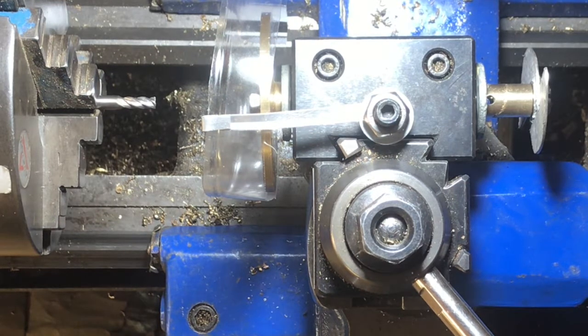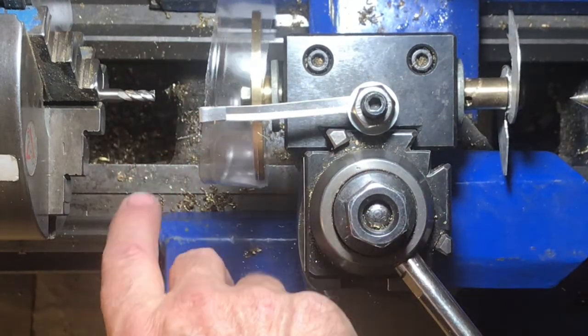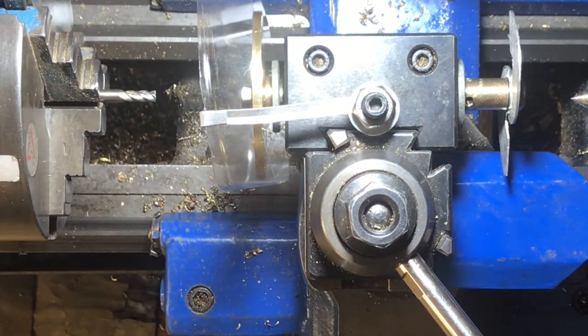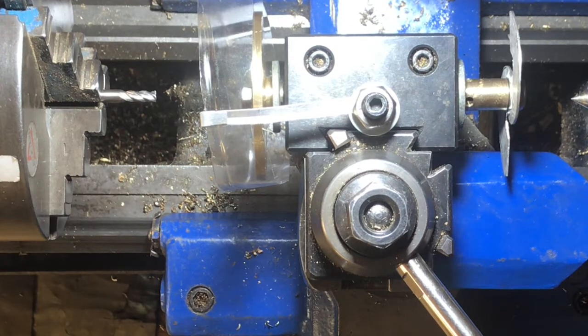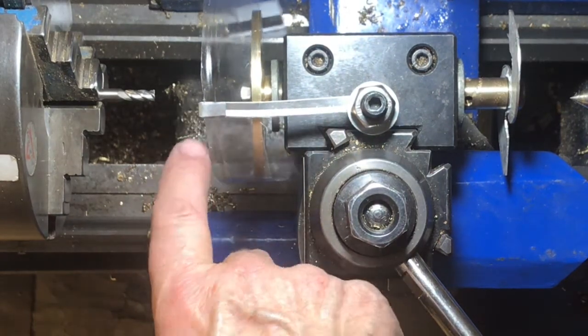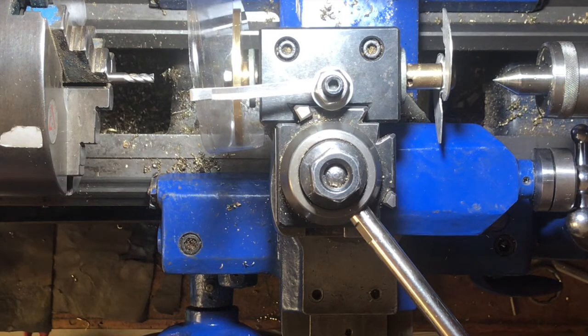You can see I've got this set up with a six millimeter end mill in the chuck. On the opposite end there's a six millimeter brass shaft in the drill chuck. On the back I've got a shaft that fits neatly in there. On one end of the shaft I've got the pattern mounted, and on the other end a blank disc of brass. I've got a little piece of a two-liter Coke bottle over here to collect the dust, because milling brass churns out huge quantities of very fine shavings — almost like dust — which is not good to breathe or get in your eyes.